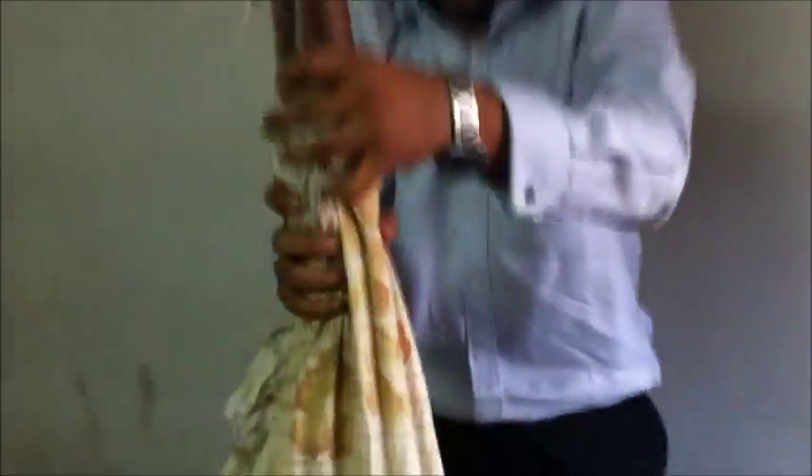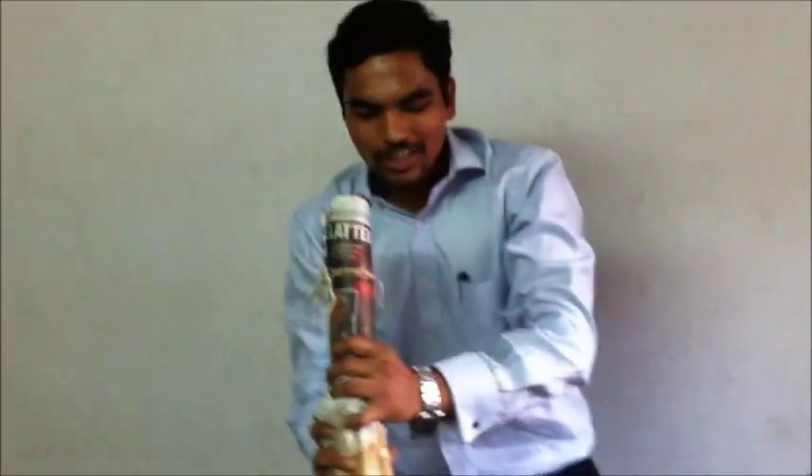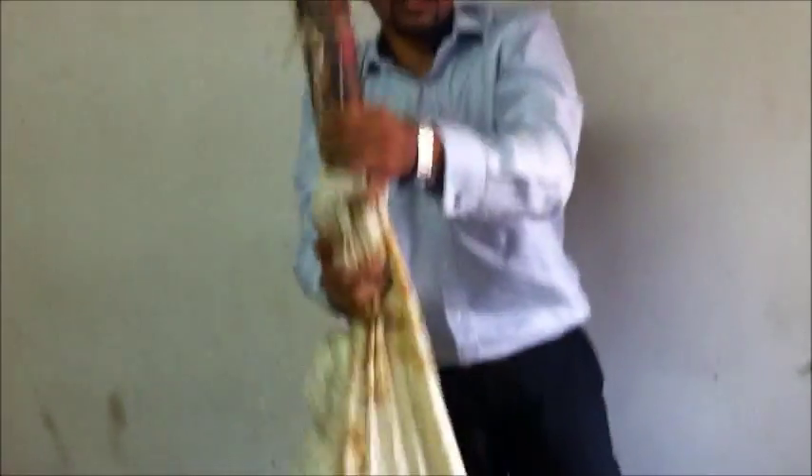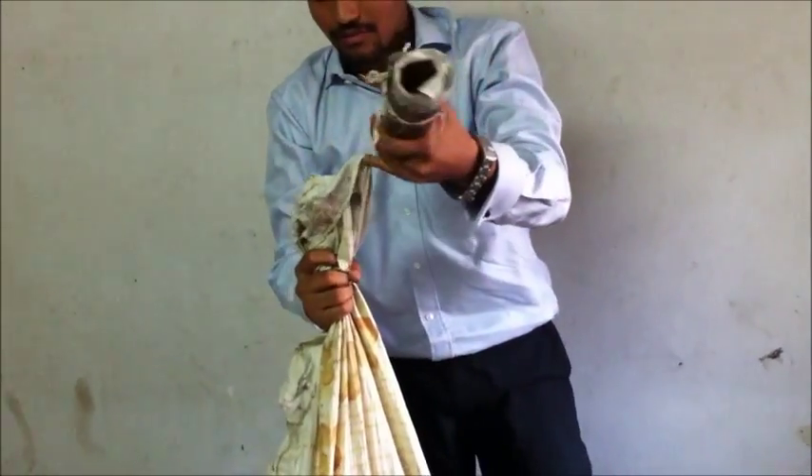Just leave it. Easiest way — hands free. Once the snake is inside the pipe, you need to make sure that the entire snake is inside the pipe. Give it two or three nudges. Make sure that you don't have the tail sticking out.